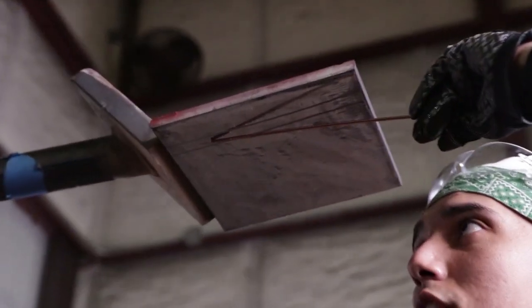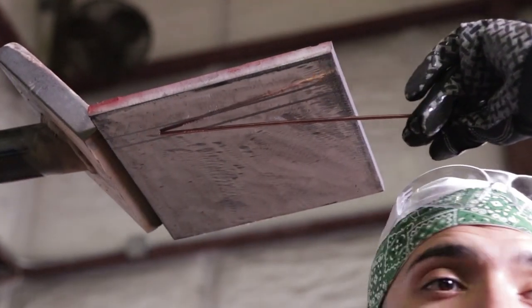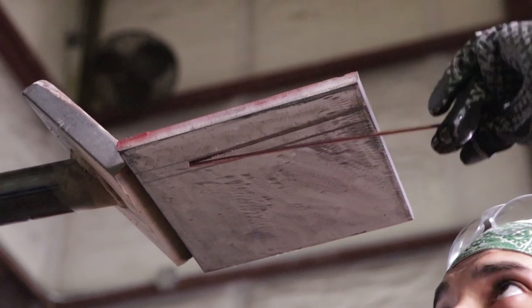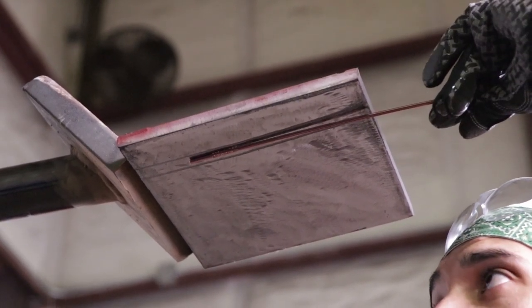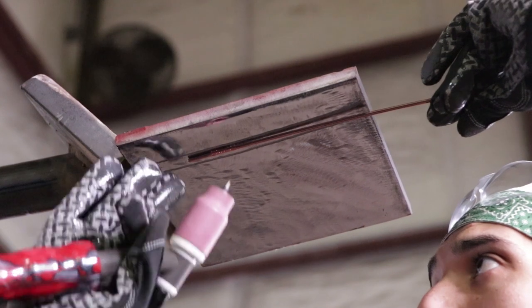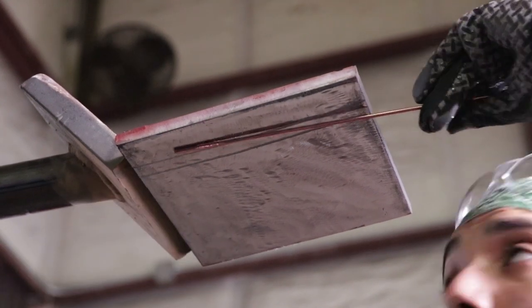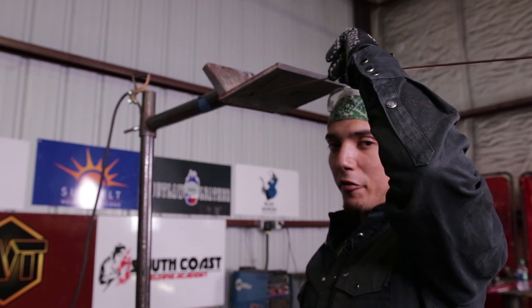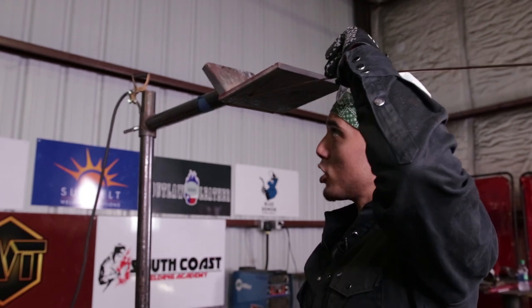I have it at about a 10 to 15 degree angle, maybe 20 degrees. Don't quote me on that. Just have an angle on there, all right? Because if you have it like this and start walking the cup, it's going to tend to bubble up on your puddle and stick on your tungsten. Make sure you have an angle just like this, on everything that you do, whether it be flat, horizontal, vertical, overhead, make sure you have an angle like this,